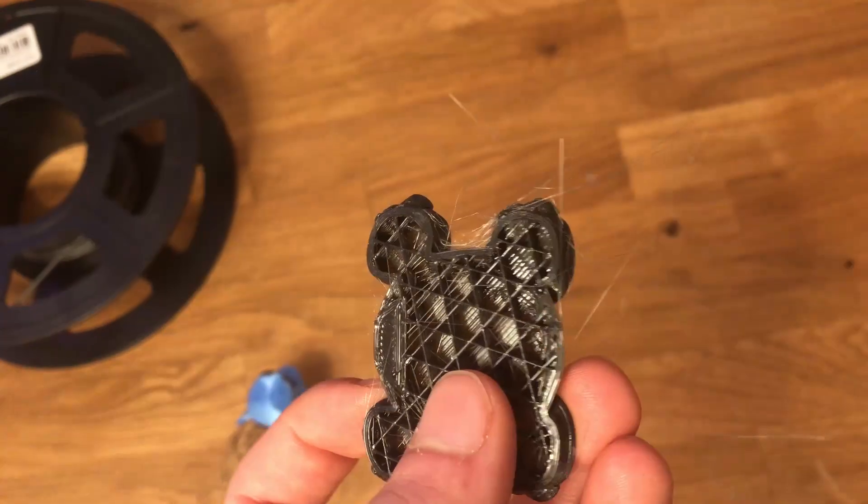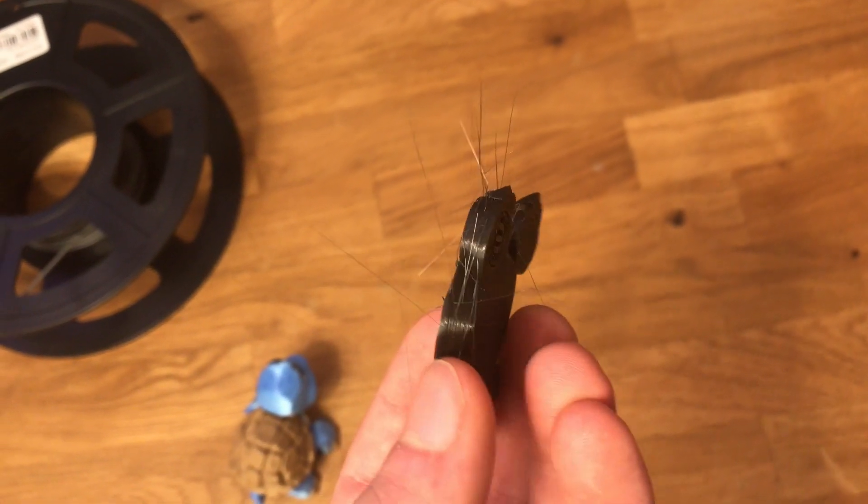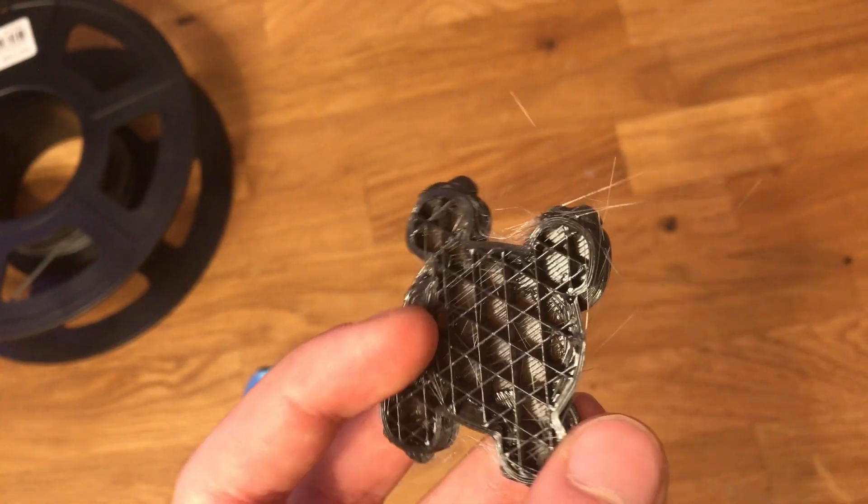The stringing is not related to the multi-material upgrade — it's actually related to my slicer settings. I had a really good proof of that when doing the print that just finished to my left. Even when working with the industry model which printed perfectly before, now it has that many strings using some different slicer settings. I printed it by mistake and it did the exact same stringing on a single-material setup, so it means it's strictly slicer related.